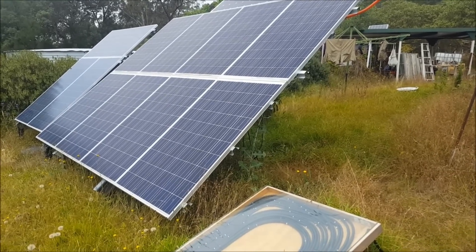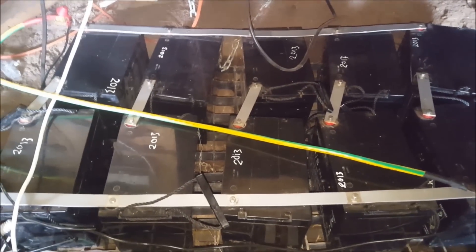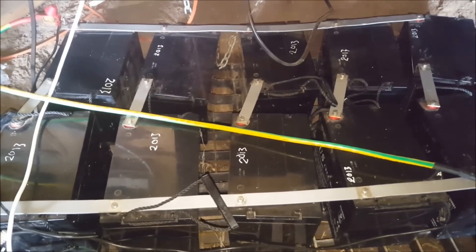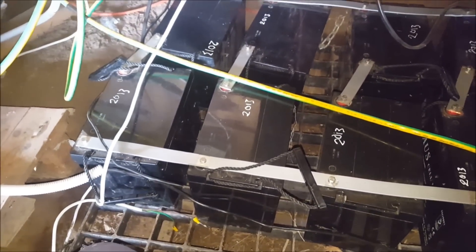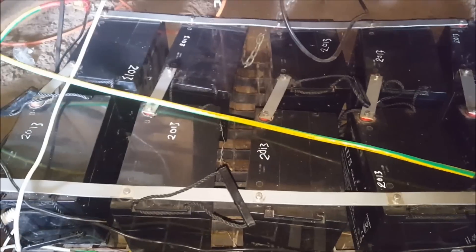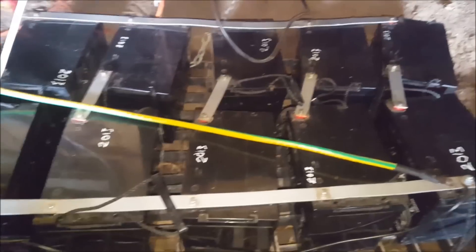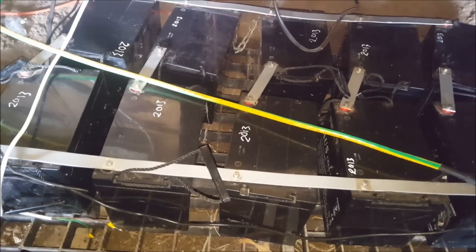I'll go under the house and see what else I've done today to get me all sweaty. So this is my 24-volt 375-amp-hour battery bank — that's ten 12-volt 75-amp-hour batteries, wired series-series-series-series, then all hooked up in parallel. Less than ideal, but these are free — do what you've got to do. You can see '2013' written on there — that's when they were installed into a shopping centre up in Canberra. They did two years of service up there and have been pulled out. I've been running off them just fine for the last couple of months.